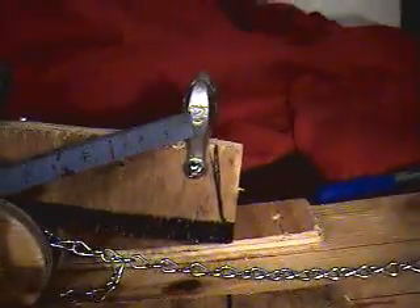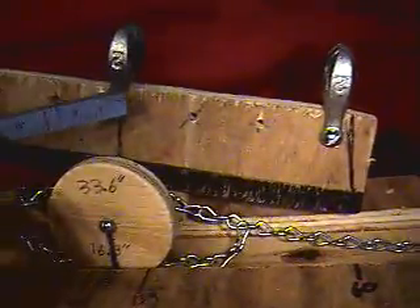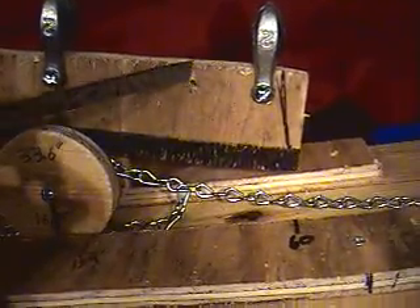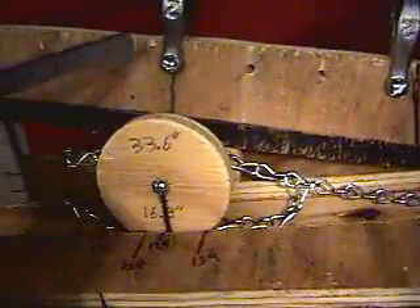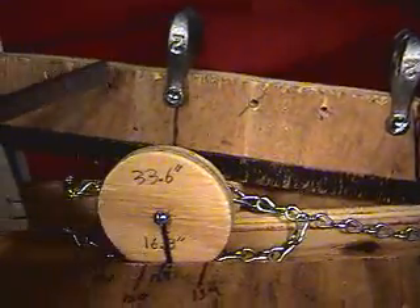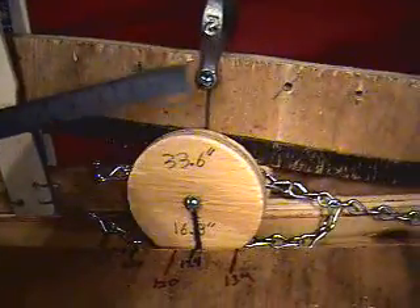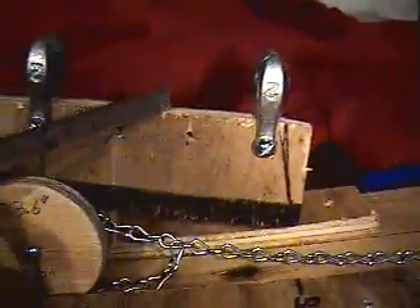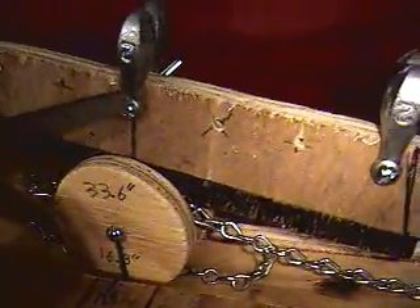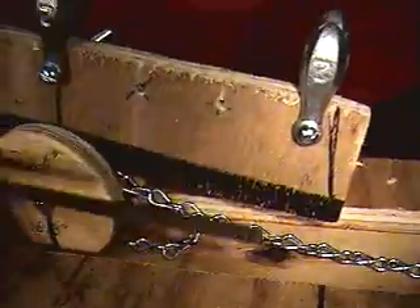I've added two pairs of weights. Here's our 60-inch mark for the weight box — I put four ounces behind that, with a hole so I can move it back for the next wheelbase test. That will move back the exact amount the front axle will move back. Same with four ounces here roughly over the front axle to represent our engine, with an adjustment to move it back the exact same amount. This accounts for the fact that on a shorter-wheelbase vehicle the engine stays in the same location relative to the front wheels.